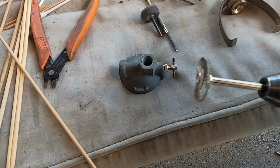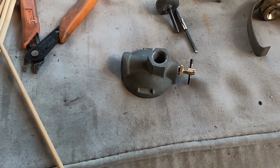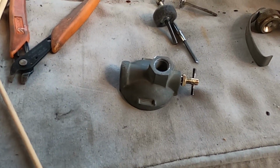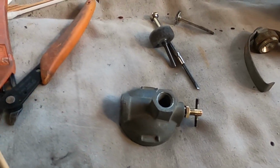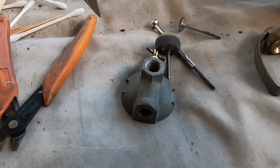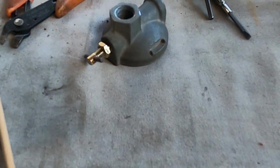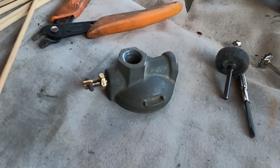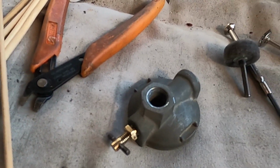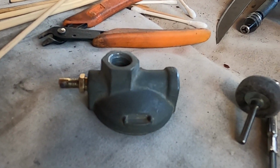I'm using a stainless steel brush because it's hard and will cut that stuff fairly fast, the die cast. You could use a brass brush, but it will sometimes leave a brass tinge to the die cast. I wouldn't use a plastic brush because I've had more problems with the plastic brush leaving residue that is just as bad to get off. Now, luckily enough, this thing had no paint, but it's got patina on it, if you can tell, that would rival an original Sweet 16 car that's been sitting with no paint on it. So the polishing technique will work for restoring old Redline Hot Wheels and Matchboxes too.